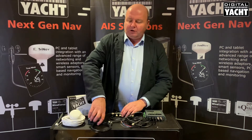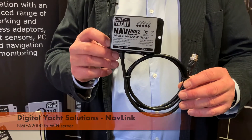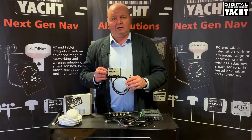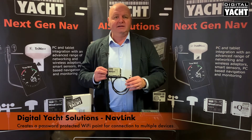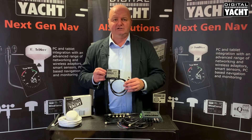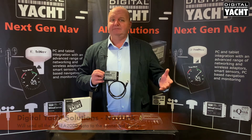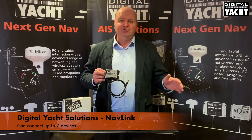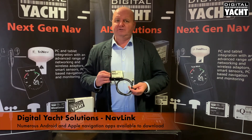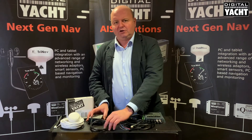We also include a product called Navlink with our system. Navlink is a NMEA 2000 to Wi-Fi server, so it takes NMEA 2000 data and creates a password-protected Wi-Fi network on your boat, which iPads, tablets, smartphones, PCs, Macs — anything with a wireless interface — can connect to. It sends all the data on the NMEA 2000 bus to the connected device. Up to seven devices can connect, so all your crew can use an iPhone or iPad for navigation, and there are tons of different iPad and Android apps available for charting, instrument displays, and so on.